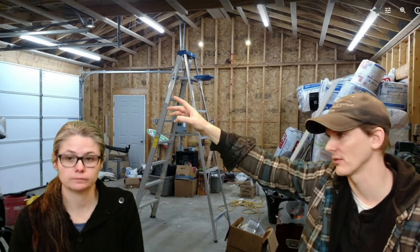So another thing here, this is below the scissor truss, so that last scissor truss has those vertical 2x4s. These had to be put in all one at a time, so that was a pain in the butt to do. It was really just so that you can insulate it. Because if you look at it, there's nothing between here and here. This truss sits here and it sits over there, and there's nothing here except for the sheathing. Actually, you need to put those in to nail the sheathing too.